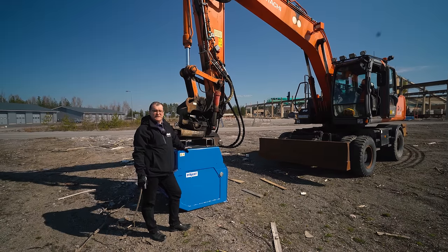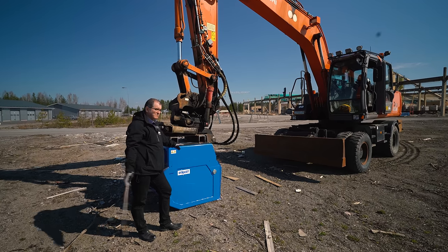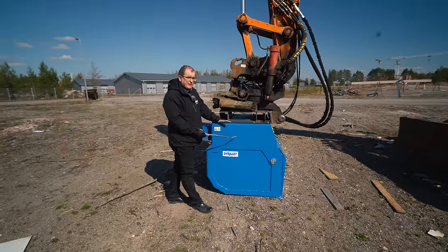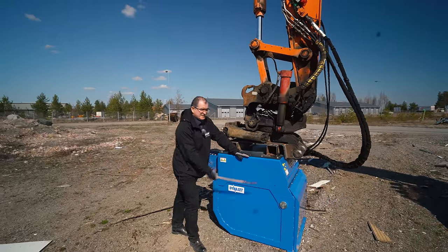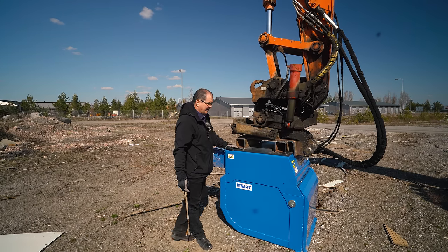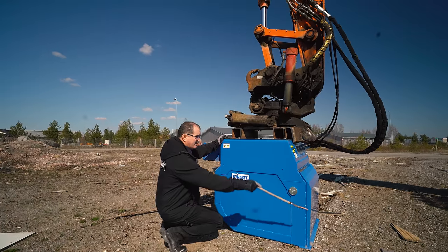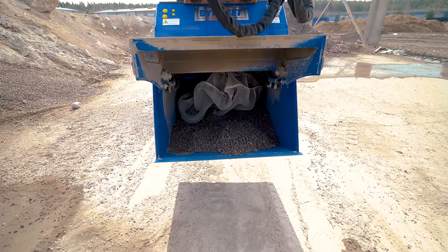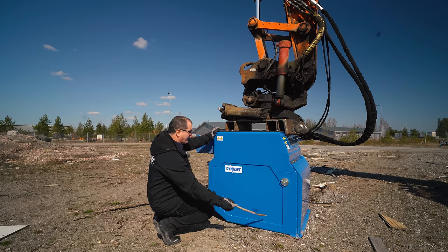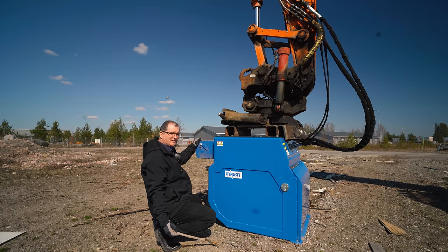The HRVB is basically one big vacuum cleaner based on high volume, high velocity airflow. This airflow will move and gather all the light trash you need to collect. The airflow is created by this area here, which is the air turbine — a hydraulic driven air turbine, essentially a big fan. The airflow created will go through the trash tank, either coming in from the hatch or from the manual hose, should you choose to use it, then through the turbine area.